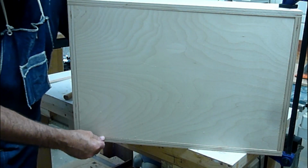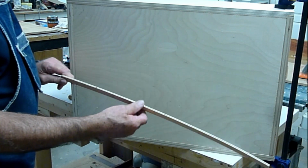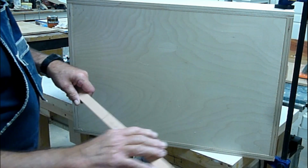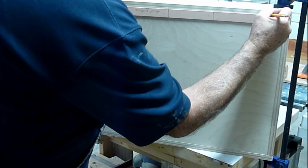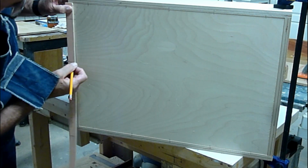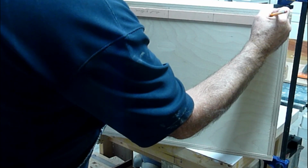If you've got a good fit, go ahead and slip your side piece into place. If it fits right, you can go ahead and mark your biscuit slots. Now you can use a measuring tape or a yardstick, but if I'm making 2 or more identical drawers, I use a story stick. I simply take a 1/4 inch sliver of plywood and make my biscuit marks on it. I'll allow 1 3/4 to 2 inches for the edge and 3 to 4 inch spacings for the inside measurements. I just simply go around the perimeter of the board and make sure that I mark both sides of each joint.